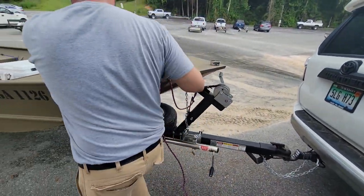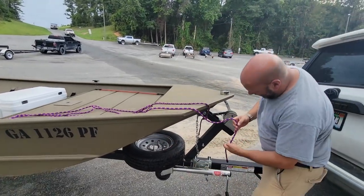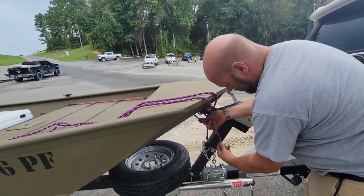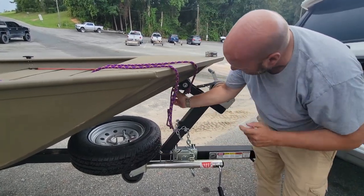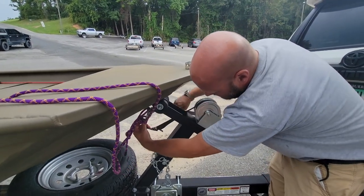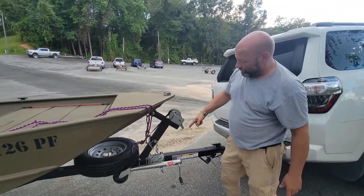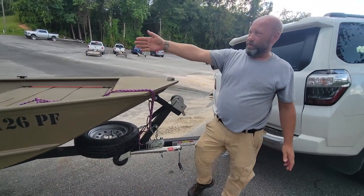The other end we're going to lay right out on the boat like a strip, so it's loose and won't tangle — it'll feed itself off. The other end, once we take this off, is going to go through the eye of the boat. So we have this going this way, coming through, wrapping around, going back through — and now we have this bowline tight on the boat. We loosen this just a little bit to let a small amount of slack out, then lock the winch again. Otherwise you'll feed all that line out. When I back this boat in the water, it'll go right off the trailer, but this rope connected from the boat to the eye — connected to that strap — will let the boat go out on its own.